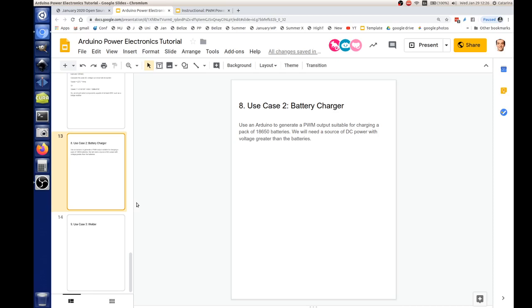The idea was to control the voltage. What was our initial idea? Well, the initial idea was to use an IGBT to drive directly from the batteries, using PWM control to control the welding. But the initial circuit we had didn't have any shunt resistors. We didn't measure any voltage or current of the output, so we didn't have feedback for it. And the result was that we got fried IGBTs. We got at least 8 fried IGBTs.